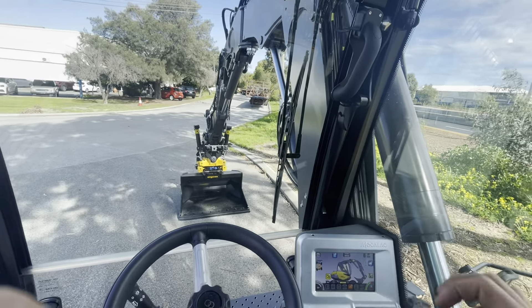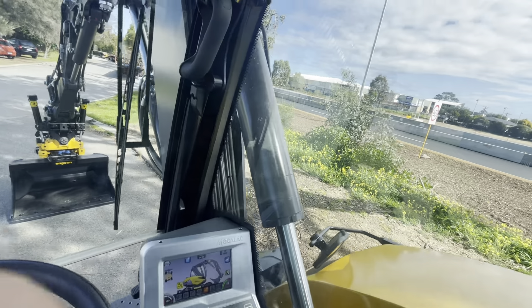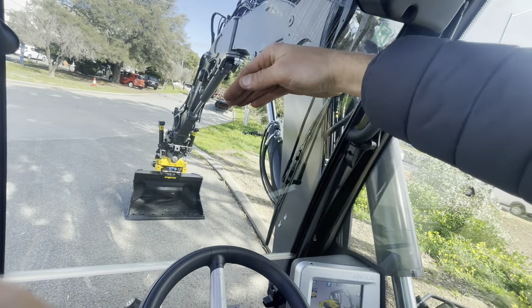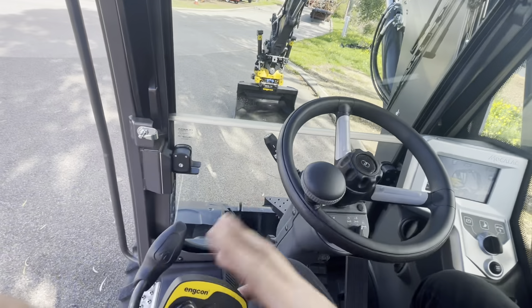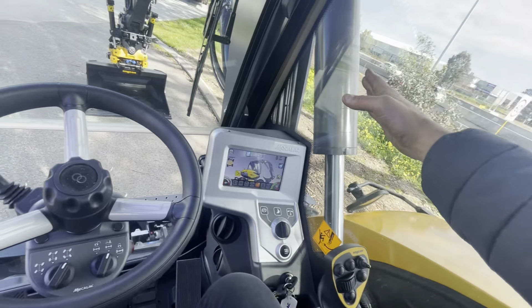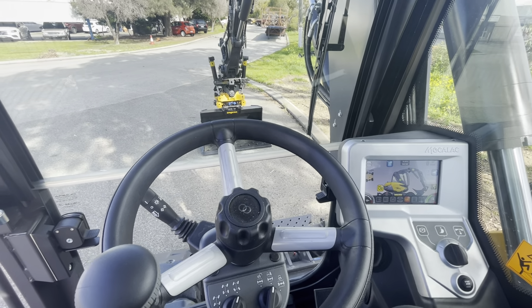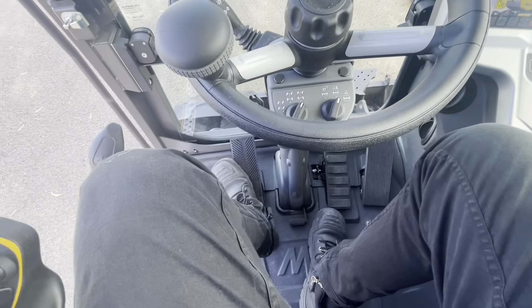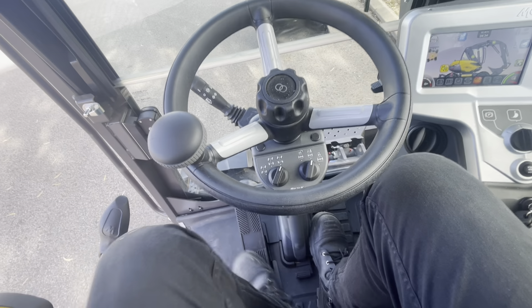And then over here — this button here. So when you're lifting and you want the boom just to go straight up in the air, you can still make use of having the middle cylinder. You hold this button in, and now when you bring this backwards, instead of the rear cylinder coming backwards, the middle cylinder will go straight up. Really handy if you've already got this all the way back and you just want to go straight up in the air without the dipper stick going out — you hold this button in and now this joystick only does the middle cylinder and this joystick only does the dipper stick. When you let go of that button, this joystick goes back to doing the middle cylinder and the dipper stick, while this joystick does the back cylinder. It's an option that needs to get turned on with the MEC Diag by your dealer. A great little feature if you're used to a mono-boom. On the MCR, a lot of people in Australia like to use the foot pedals for travelling, and you can't really take your foot off and use the third pedal — that's where that option was developed for us.